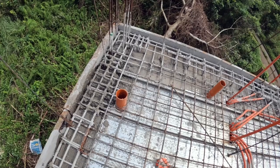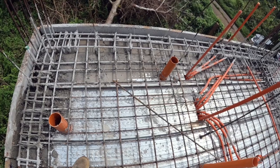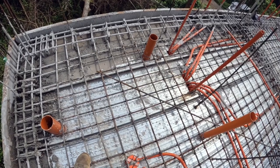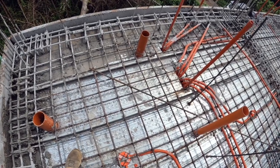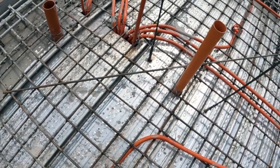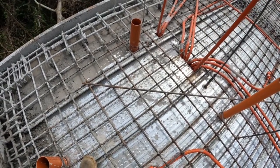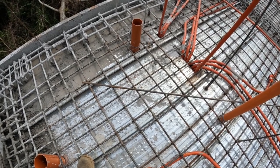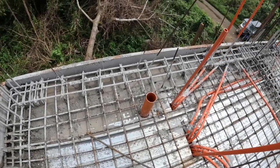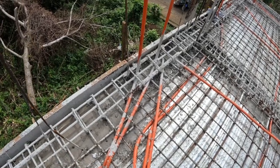So what you see as I walk around, first is the rebar that we're using. All over the mesh, the spacing of the rebar is about 4x6, 12 millimeter rebar for the main mesh. Steel decking, I think it's called pan type, and it's 1 millimeter thick. We have poured the beams. We're not complete yet, but we're making our way around the perimeter, pouring the beams.